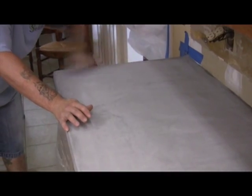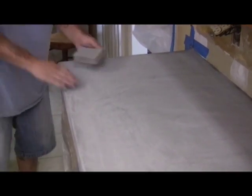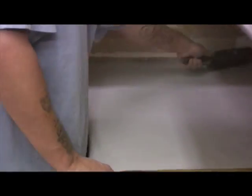If you decide that the top is still not quite as smooth as you'd like, simply add another layer of top coat, following the same process as before, and then allow several hours of curing time before proceeding to the next step. When you like the smoothness, carefully and thoroughly remove any dust and particles, being careful not to leave any scrape marks which might show up under the final clear coats.